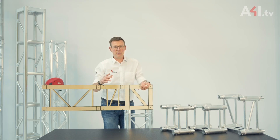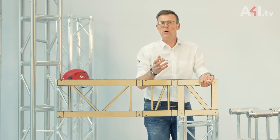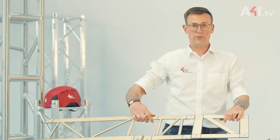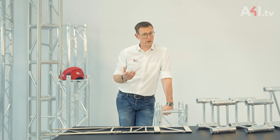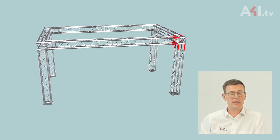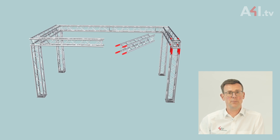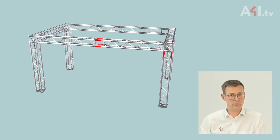So it has the same load carrying capacity as the regular truss. Unfortunately, there is no rule of thumb for when spacers without diagonals should or should not be used. This decision always depends on the specific configuration and load. As a general rule, spacers that are not equipped with diagonals should be placed in a position where there is low shear force only.